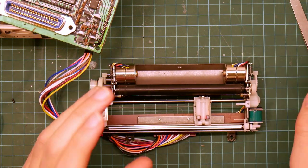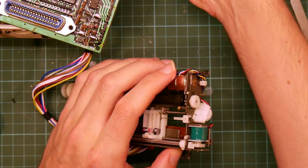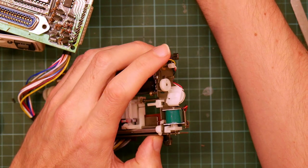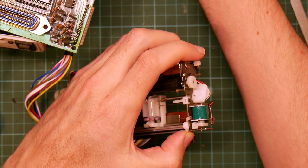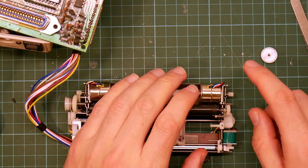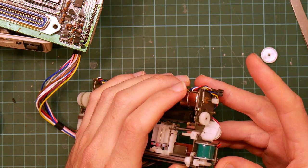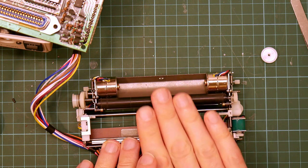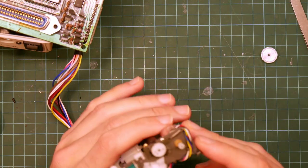Quick update. I discovered something. I tried removing this gear, and then made the motor drive by pressing the button. You can see that it does indeed go around. But if I rest my finger on it, the motor stalls and there's a loud grating noise. There is very, very little torque available — I'm not pressing hard on the motor at all. There's just not enough torque there to operate the mechanism. So it's possible that this is all working absolutely fine mechanically, and the motors have failed, which is weird.